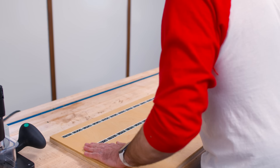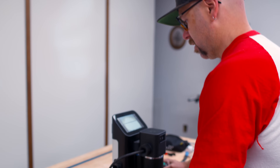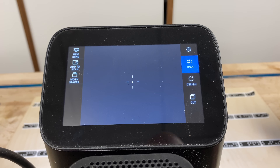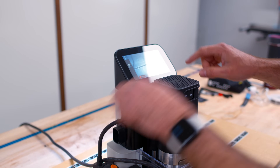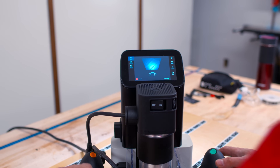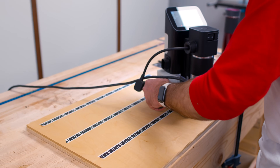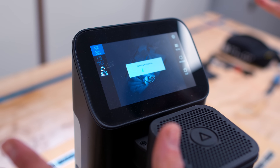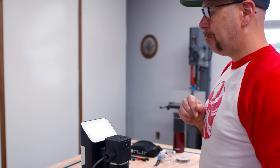They don't have to be super parallel or anything, and that should be plenty for what we need to do. We put this up here and we need to do a new scan. There's a little camera in the front. To start the scan, we hit this little green button on the controller, do one of these passes, then I can hit finish. It's going to do a final stitching — that is actually the captured image it put together — and it's going to show me right where my bit is going to go.